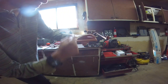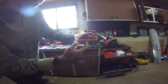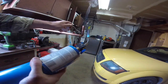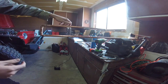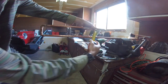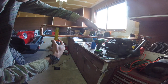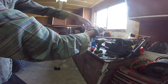The last cut is for the bottom piece of the J — the piece that connects the long and short end. I'm going to cut this to about five centimeters, or about two inches long; it's not really super critical. Here's the J-Pole mostly assembled. I haven't soldered this joint yet, so I want to make sure it's square before I solder it — line them up, measure the gap, get it square, and clamp it before soldering.